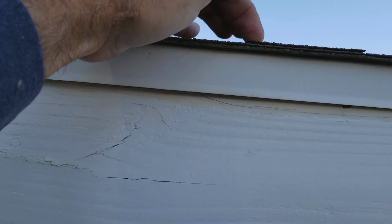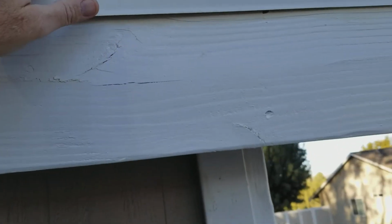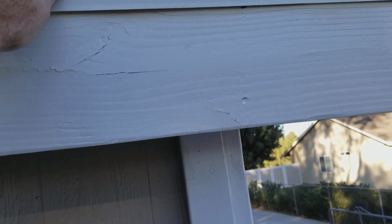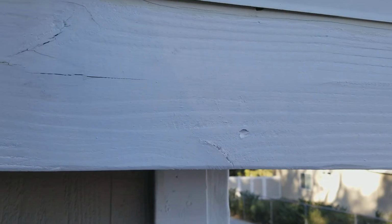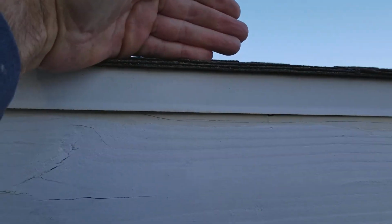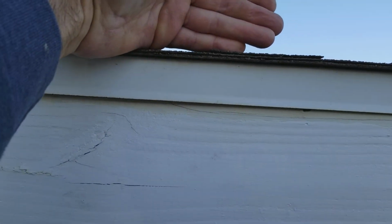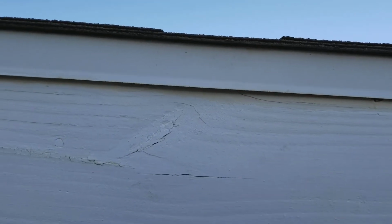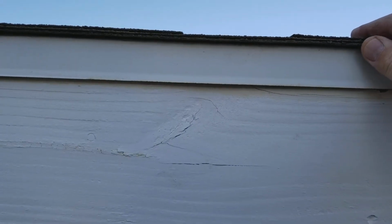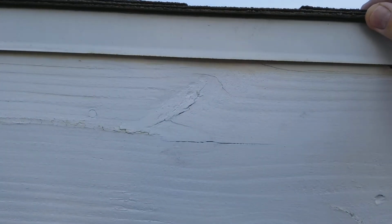And I said, no, I can't paint it yet. She goes, why? I said, the fascia boards are full of water. She goes, what do you mean? What's happening? She had enamel on the fascia. They had paper up to halfway across the fascia board and exposed wood that much. And you might say, well, that was a tile roof. The paper is typically your moisture barrier. That's your final moisture barrier.